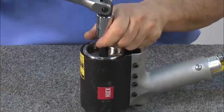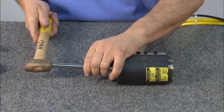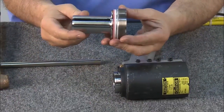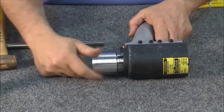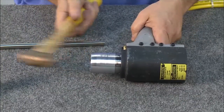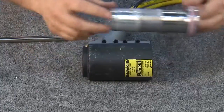Remove the wrench and lay the tool on its side. Using a long rod, insert it into the back cap and hammer it out the back of the tool. Now that the piston and back cap have been removed, screw in a Huck assembly bullet, which is available in the Huck tool service kit. Drive the piston out by tapping on the assembly bullet. Remove the piston bullet from the rear of the cylinder.